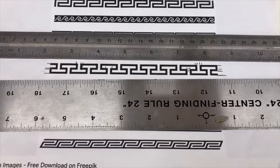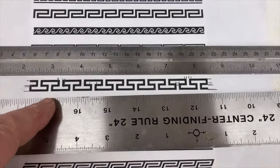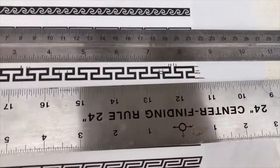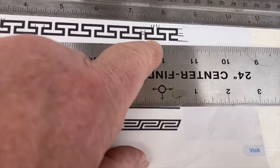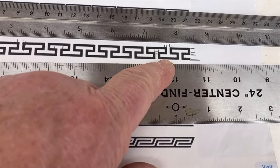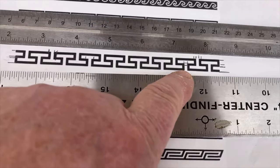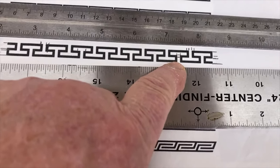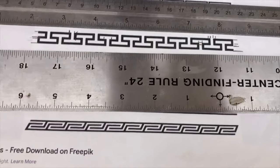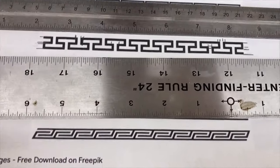So that's pretty much the pattern that I just showed you in the last video. And it consists of three separate rings. This part right in here is laminated together with wenge and maple, quarter inch wenge and maple, about a half inch thick. Then there's three uprights right here. There are two wenge and one maple, so the grain's running in the opposite direction. And the top and the bottom of that is created the same.